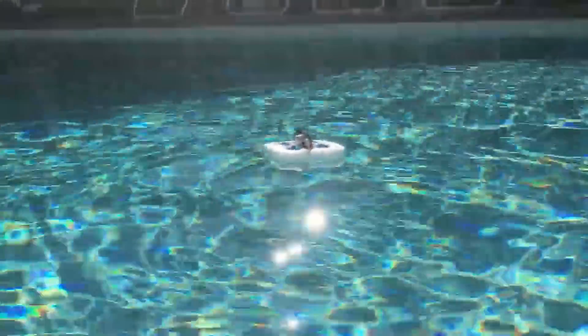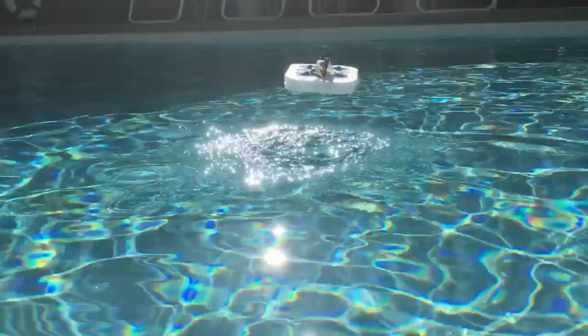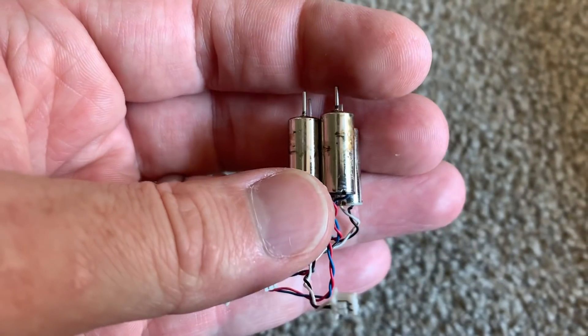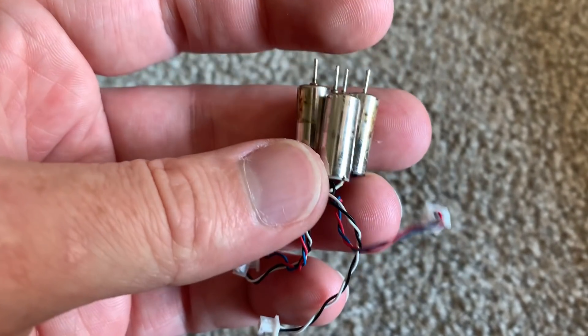With a little bit of luck we'll be able to fly around in and on the water and we might even be able to see underwater, which would be super cool. I did something similar about a year and a half ago. I took a 65 millimeter brush drone and I made it float — it was able to land on the water and take off again — but it was not completely waterproof. After just a few splashes it would start malfunctioning, and like a week later I discovered that the motors completely seized up with rust because they were brushed motors. There was no way for them to dry out properly.